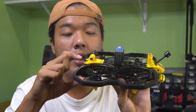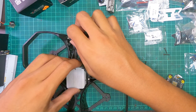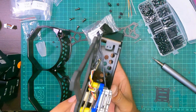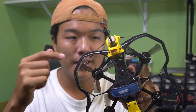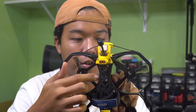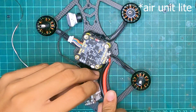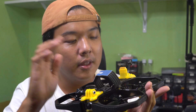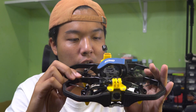The height of this frame actually accommodates only a Beast AIO at the bottom as well as an air unit on top. So once I put the stack in there, I did not have enough height — I couldn't put my air unit light on top, so I opted to put it at the back. But as you can see, it kind of overhangs towards the back here. So instead of stacking the Vista normally, I opted to stack the Vista sideways. Even that leads to another problem — the Vista at 90 degrees is still too tall for the height of this frame.